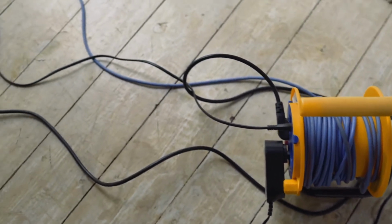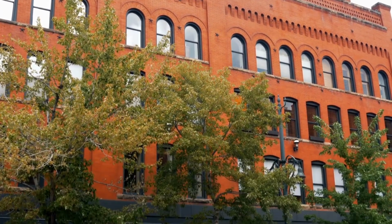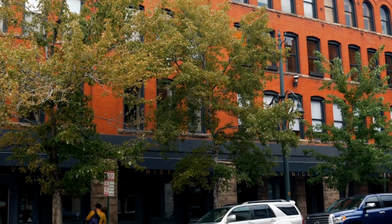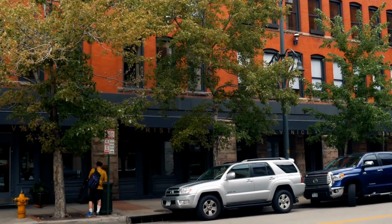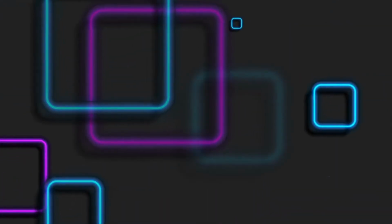Any electronic background noise will be picked up by hearing devices in T-coil mode. This is usually the result of inefficient electric equipment or defects in the grounding of the building. This hum and static can be distracting if too loud, and can make a hearing loop impractical. Background noise in the loop signal range should be measured prior to considering a facility for a hearing loop.